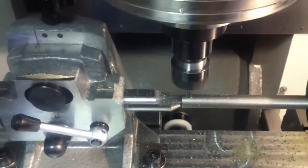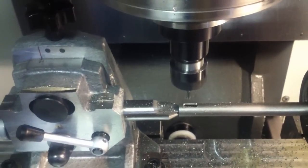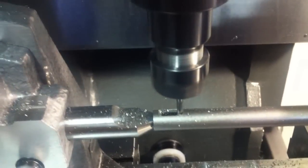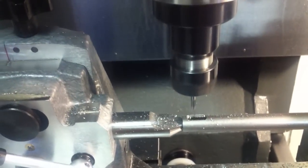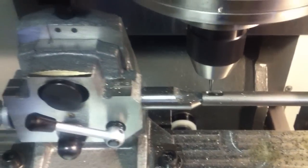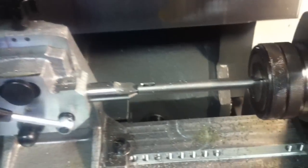So it's going to come in and mill a little pocket, and then a couple of holes to screw the pocket clip in. So there's a slot. Now it's going to switch to a smaller end mill. So now it's switched to a smaller end mill, and we'll put 2 holes in, clearance for a 2-56 screw. And that operation's done.